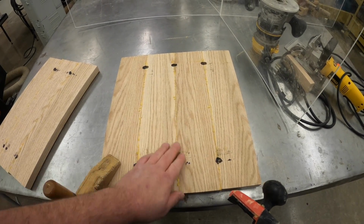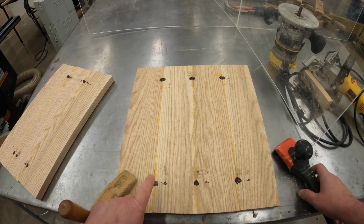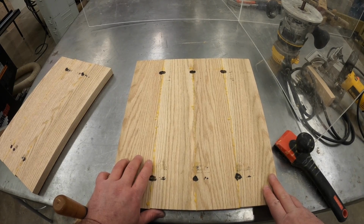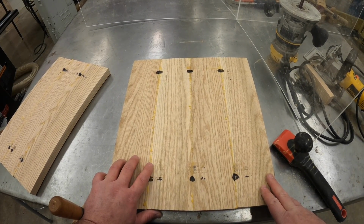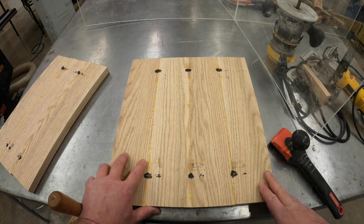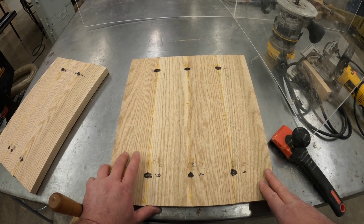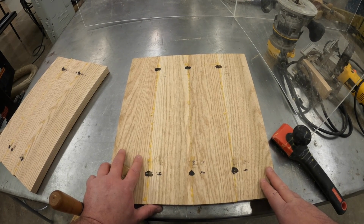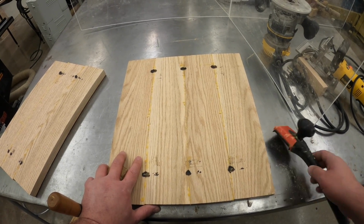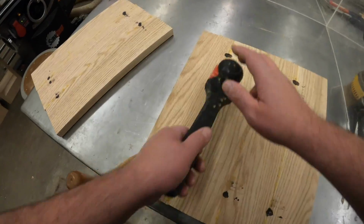And we're gonna hit all these ridges of glue and get them worked down so that it can safely go through our machine. If we leave these ridges of glue, another thing that could happen is if we take it to a cutter like a saw or a router bit, the glue dries super hard. So if the router or saw is coming along cutting the wood and all of a sudden it hits something really hard like a bead of glue, that can damage the carbide teeth on our machines. So we want to remove it for that reason as well, so there's not this big bead of glue for the carbide to hit. So I'm going to take my scraper and I'm just going to scrape up and down the wood and work these beads of glue off.